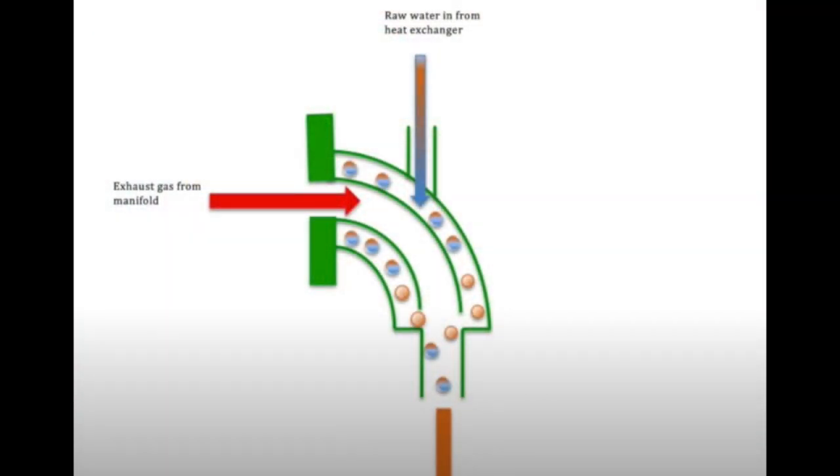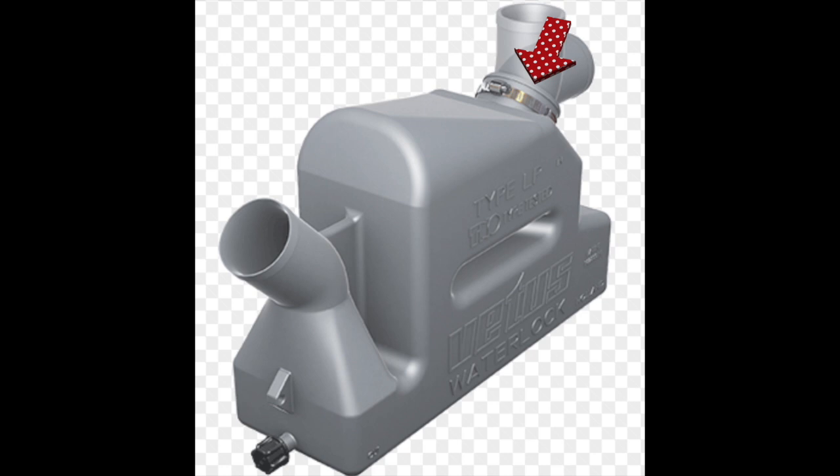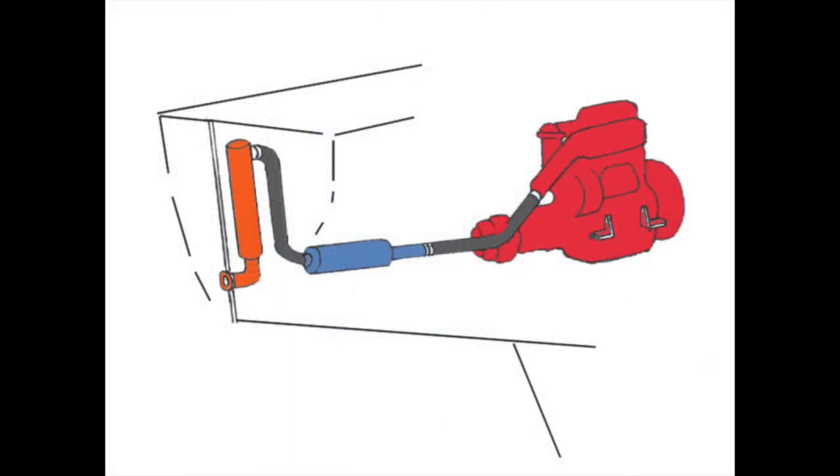After the raw water has been through the heat exchanger it then gets injected into the exhaust elbow. This is another critical part — these elbows can become blocked, carboned up, or the aperture into them becomes smaller. There's a link to our video on this in the description. Once the raw water has been mixed in the exhaust elbow it goes through a muffler or waterlock, out the other side, and then to your exhaust pipe — this can be a source of problems if you've got a Volvo type waterlock. The water then leaves the muffler and goes out through the transom, but not before going up and over a gooseneck, which stops seawater or waves going back down the exhaust and filling the waterlock. This gooseneck can be a component part or part of the exhaust but it must be there.